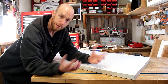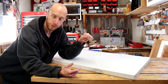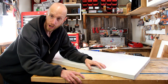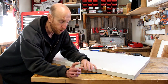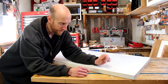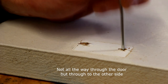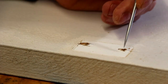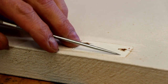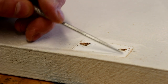Here I've got my door removed for the repair. If you need to remove your door, just knock the pins out from the bottom straight up. Sometimes you have to get in there with a pair of pliers to pull them out, but this thing is not really that heavy. Once you get the pins out, you can just take the door off and work on it where it's more convenient. The first thing I'm going to check before I make a repair — I'm just going to use an awl, or you could use a small screwdriver or toothpick — and just make sure that the hole does in fact go all the way through. There's nothing in there. I can feel that strip is right about here. So if the towel bar was probably an inch longer, half inch on either side, it probably would have been okay, because it would have been into a little tiny bit of structure that these doors do have.